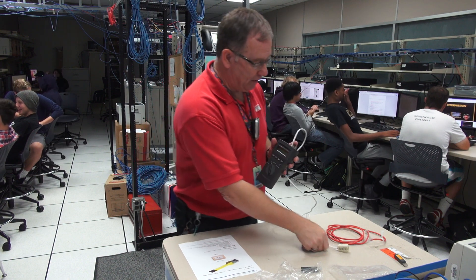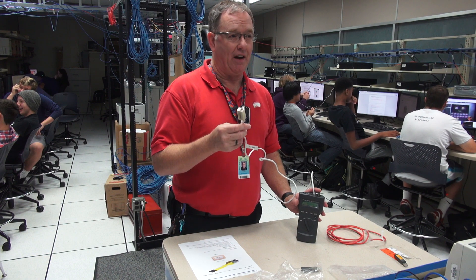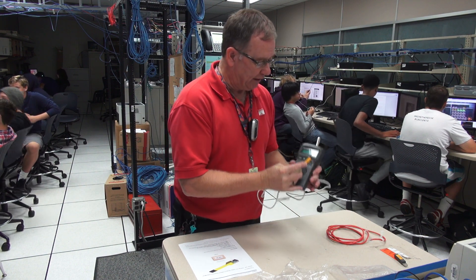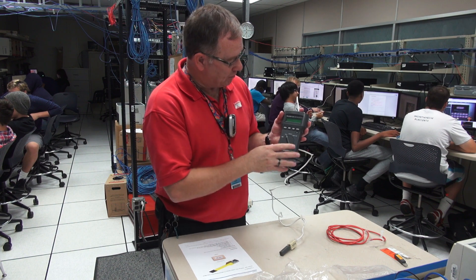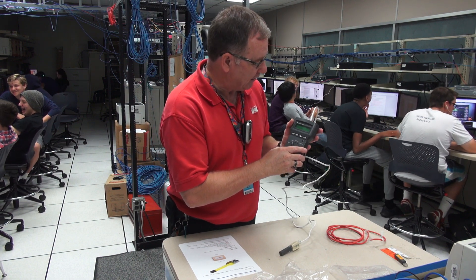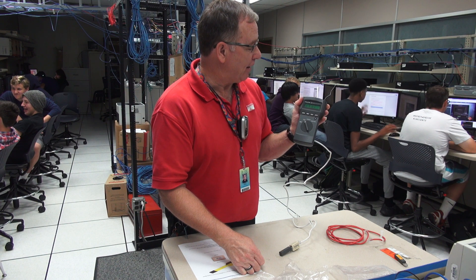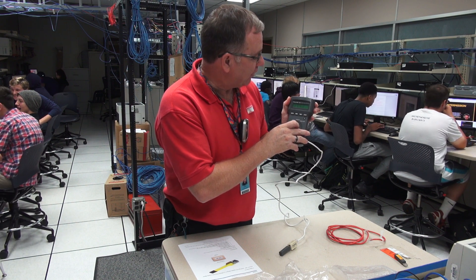Actually it says it's good — I see why. I forgot to plug in the cable ID. Without the cable ID, the meter doesn't have a way of telling miswires — it's just measuring the length of the wires and that they're grouped together correctly on the near end. Now I've got my cable ID plugged in, and it's telling me there's a problem — the triple beep. It says fail, miswire. Using the down arrow, I get the blinking display, and this time all four pairs are blinking — pins 1, 2, 3, 6, 4, 5, 7, and 8 are all miswired.